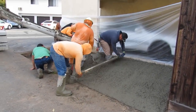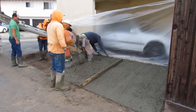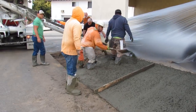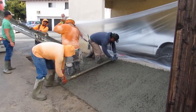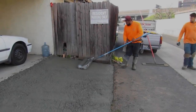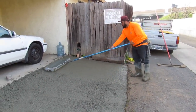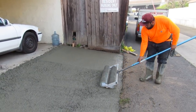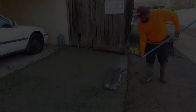I didn't have to saw cut either — I didn't have to come back and patch asphalt. When you're good, you've got two rod guys and a shovel guy. You don't pull wet concrete with a rake 20 feet across the job. This is how you screed it, this is how you get it flat. You cut joints with a cutter, then you get out there on sliders and re-tool them out. That's how a professional does it.